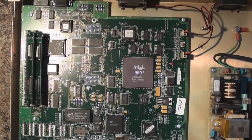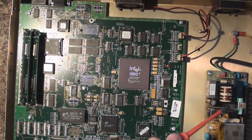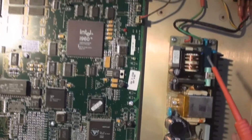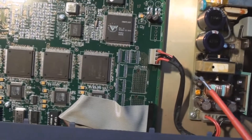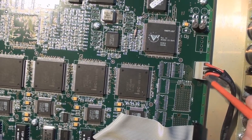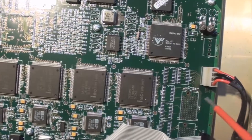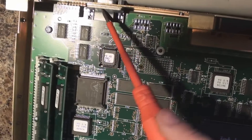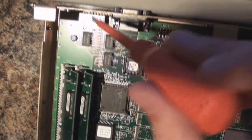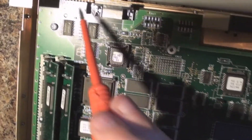As you can see, we've got two main boards here. We've got the power supply board over on this side — here we go. So we've got the power supply down here. This is a standard 230 volt or 110 volt input, giving out 12 volts and 5 volts. Now, we'll start at the top here. This is the part which has apparently gone wrong. Somewhere over here you've got all the parts which control the RS-232. We've got a series of DIP switches here, which are completely inaccessible from the back because there's no hole. So these were probably designed not to be set by the user, but rather by the manufacturer.